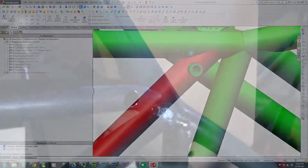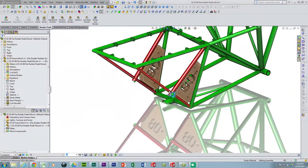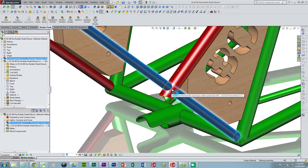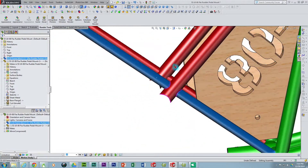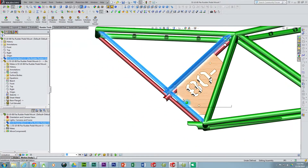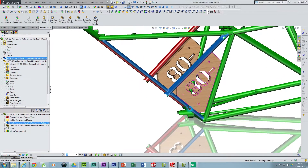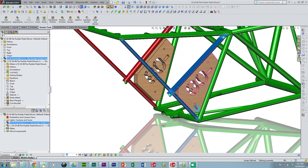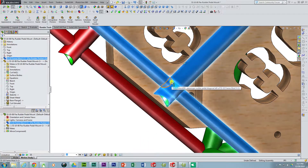It is also offset slightly from the pilot's seat to the forward gearbox tubes. On the other end of the tube there is a through hole for the tube that runs from the forward gearbox to the pilot's forward seat section. Note that this hole is not exactly 90 degrees to the passenger rudder pedal support tube. However, it's close enough that during the cutting you can drill completely through it and then simply clean it up with a die grinder once finished.